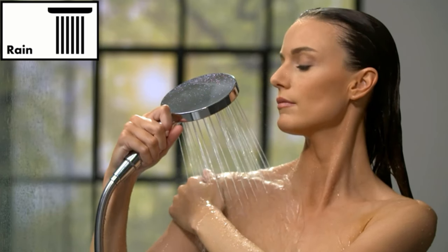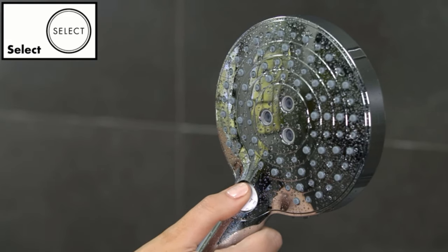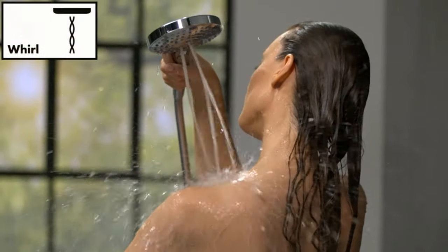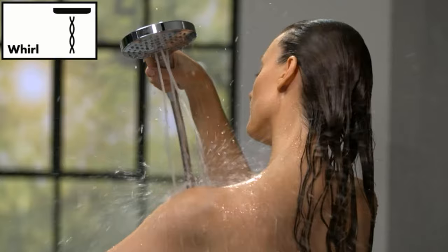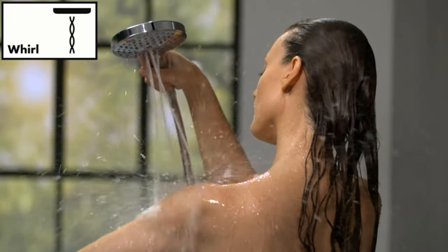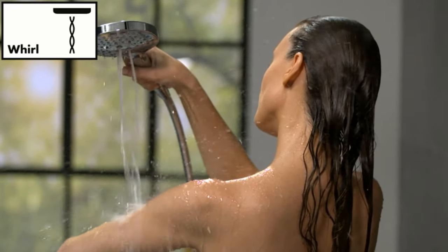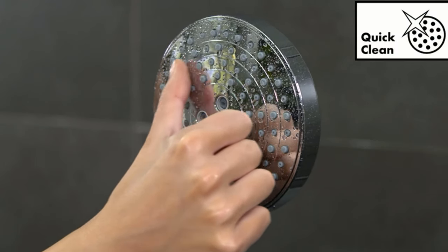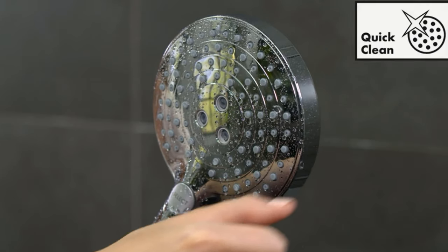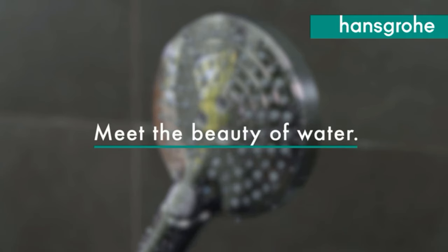The arm is made of solid brass and is of excellent quality and superior engineering. You can add to the appeal of this shower arm by brushing it with a gleaming chrome or nickel coating. However, it will feel awkward to lift your hand to adjust the shower head arm unless you are tall, since it has a 10.5-inch vertical and a 15-inch reach. Additionally, the right angle on the arm gives you limited shower head options. When purchasing a shower head for this arm, you have to ensure it is narrow enough not to bump the shower arm or wall. You'll also have to contend with the fact that the shower arm weighs over 3 pounds, which means it is heavy.